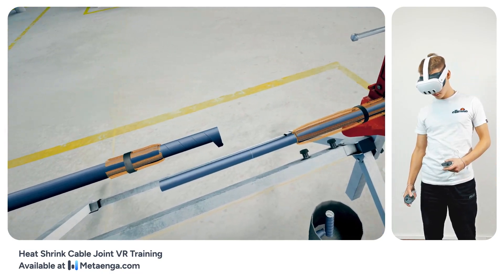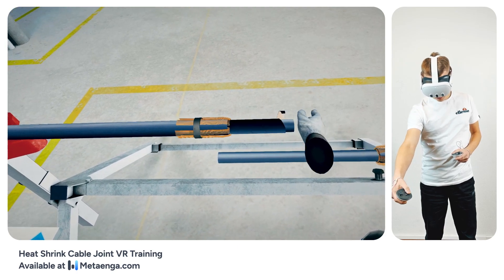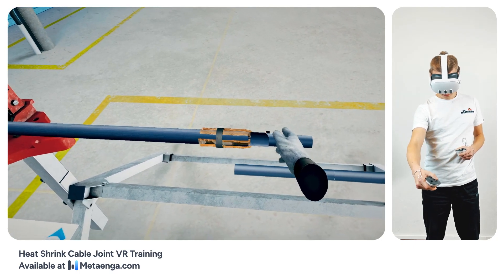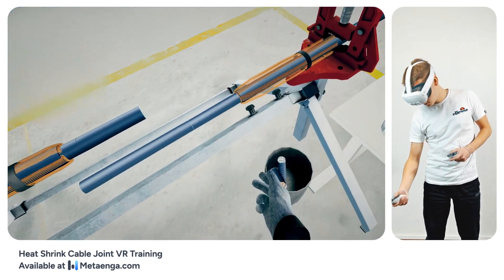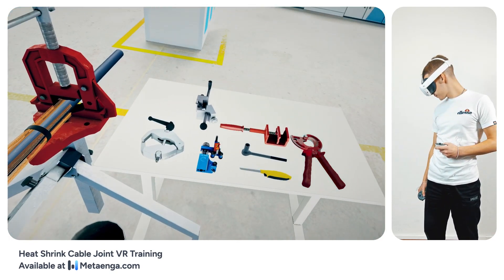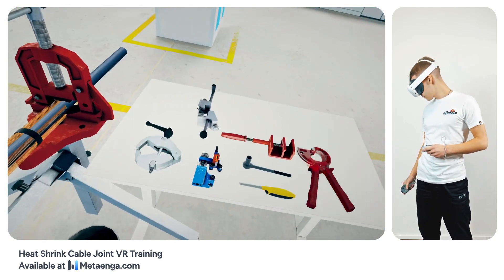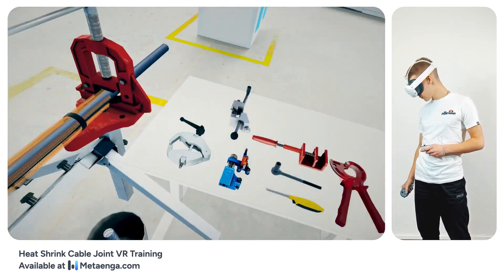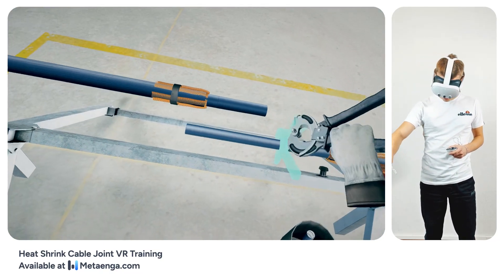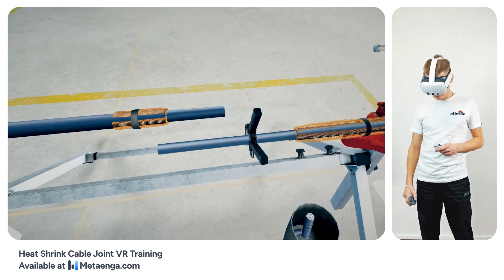Remove the secondary water blocking layer from the left cable by unwinding it to the length of the sheath cut. Proceeding to the right cable, trim its end so there's a consistent 195 millimeters length from the edge to the stripped sheath section. For a clean cut, use the MRK scissors from your tool set, positioning them at the desired length, and squeeze the trigger several times to make the cut.